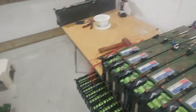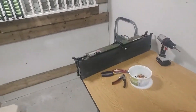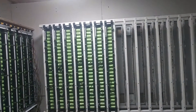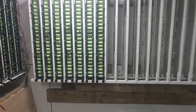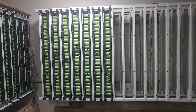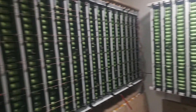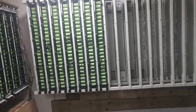One step at a time — we're stripping BMS boards, the originals. I'm gonna pile them down there. Got it started for my third bank. After I get them all stripped off, I'll check the voltage on all the cells, then I'll parallel them all together so they can balance out. Once I get a balanced voltage, I'll put this back at the same voltage and then link them together. That'll take me days.